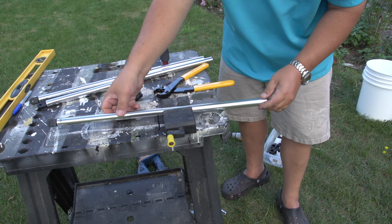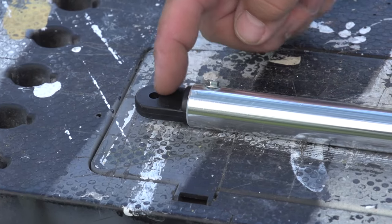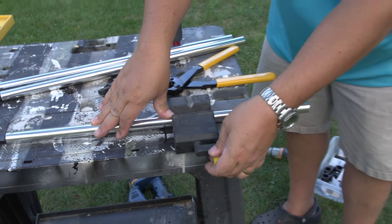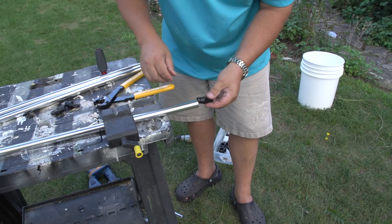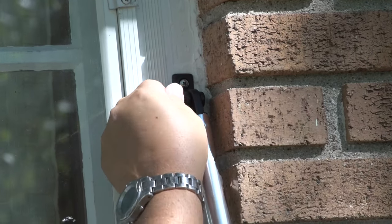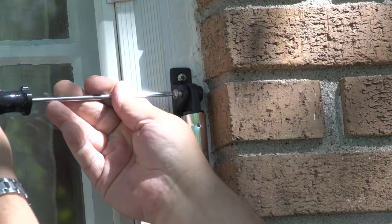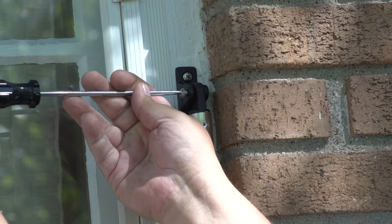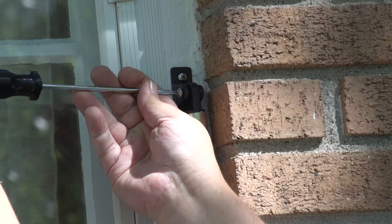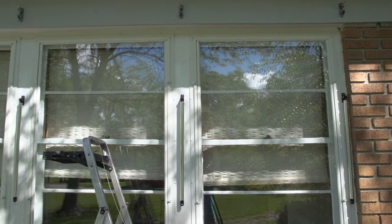This is the one we secured with a screw — you can see that screw. We need to make sure the first I-end is flat with the table and the second is up and down. We'll now install those struts onto the deck mounts that are already installed on our building. Go ahead and screw the screw all the way to its flush position. All four of our struts are now in the appropriate position. We'll now move on to the rafters.